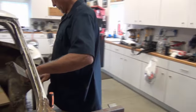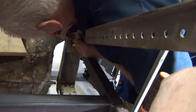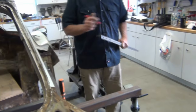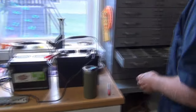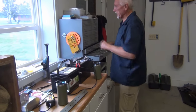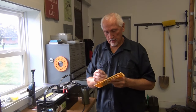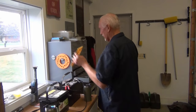Again, we're not worrying too much about side force on this — we're worried about vertical movement right there. What I'm going to do — there are already holes in this. Give me a mark right there. There's this hole right here — that's probably a quarter inch. I'm going to go up to five-sixteenths, so let's open these holes up to five-sixteenths and drill a five-sixteenths hole there.